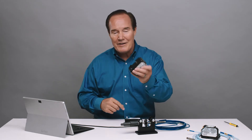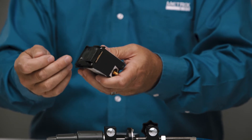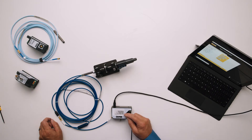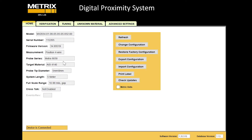I have the bottom taken off. Normally we have a DIN rail mounting on it. I took off these three screws, and now that gives us access to the USB that's underneath it. So I'm tapped into that USB right now and connected to my computer. We're going to go ahead and take data. When I look at the Metrix Digital Proximity System software, we can see serial number 112205 — the same serial number that's on the unit. We also have a position 4-wire system, MX8030, 4140 steel, 8-millimeter, 5-meter system, and we're set for 10 to 90.